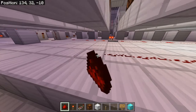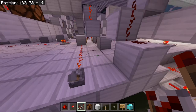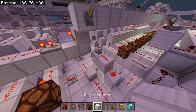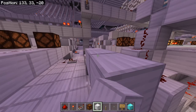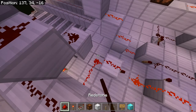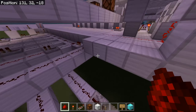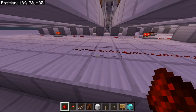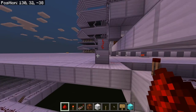Where things might get a little messy because there's all these other multiplexer control signals kicking around. This was where we had the clock for the program counter before. This is our enable signal. May have left just the right amount of space to make this work. Oh, that was our last register anyway. This doesn't need to carry on.